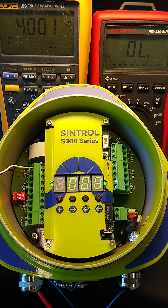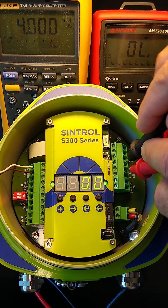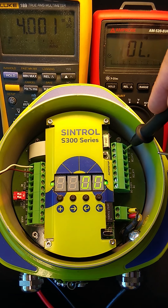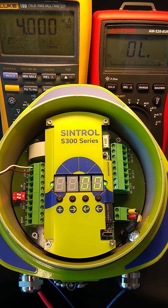You heard the relay. It's going to 4 milliamp and now it's in maintenance mode, showing continuity between C and B and between C and A. The milliamp output starts at 4 milliamps and will ramp up to about 80% of the range, which is about 16.8 milliamp, but that will take a while.